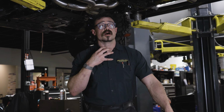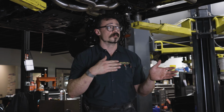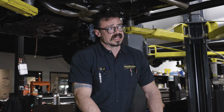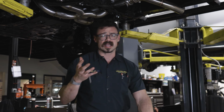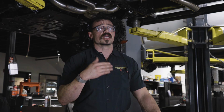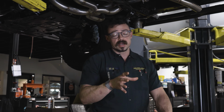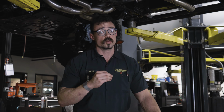And again, you could possibly have the performance change depending on how straight of a section you go, how you merge things, the angles you use, dual versus single pipe. There's so many factors here, but really when you get down to it on a naturally aspirated vehicle, you're talking, honestly, horsepower that you're not even going to notice, and it would be very hard to measure. Now, on a series like, let's just say, a Spec Miata, where the racing is so regulated and everything has to be within each other and they check things, you can get away doing an exhaust design that might net you an extra horsepower, 2 horsepower, 3 horsepower. But how many designs and how many versions are you going to make in order to net that extra 1 to 2 horsepower? And there it matters.